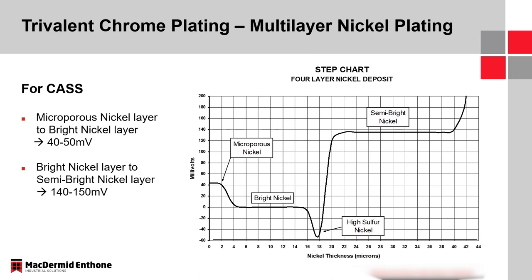Basically this is protecting my substrate from corroding. If we go back 20 to 30 years, we used to see steel bumpers with massive corrosion — those probably had only one layer of bright nickel. When you add in these other layers, you're able to control where that corrosion goes and prevent it from reaching your substrate. The OEMs specify the millivolt potential differences that need to exist between these layers — for example, between microporous and bright about 40 to 50 millivolts, and between bright and semi-bright about 140 to 150 millivolts — and that really optimizes my corrosion performance.